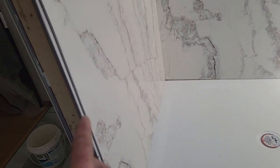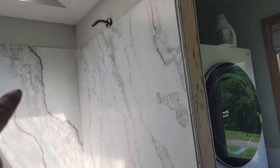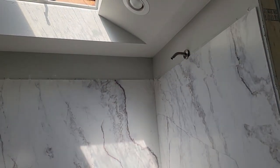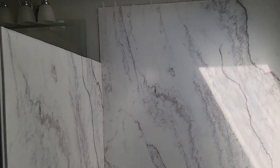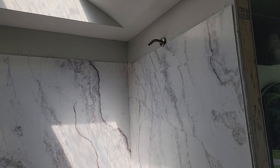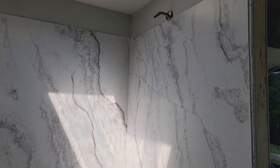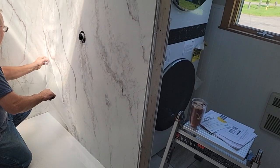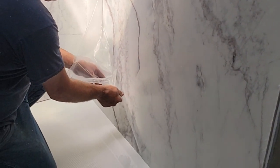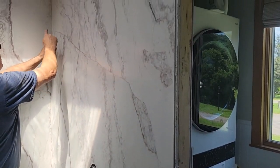See the tile on the floor and the wall — I have to cut these back a little bit because I'm going to trim this out. This is going to get trimmed — it's got one, two, three, four pieces. I think it gives you five pieces, so I'm going to try to trim this out and miter the edges so it looks like picture molding. They get glued on also. I'm going to take this protective barrier off now so I can clean this up — hopefully it'll come off in one piece. Then we've got to run a caulk down the center.